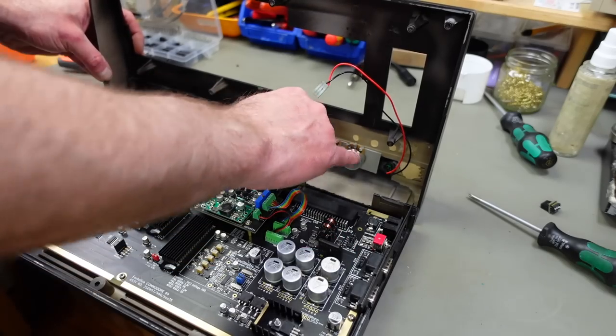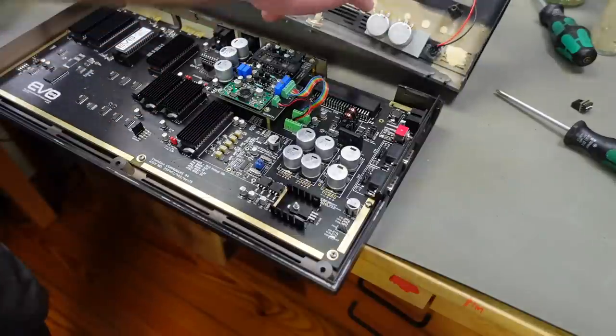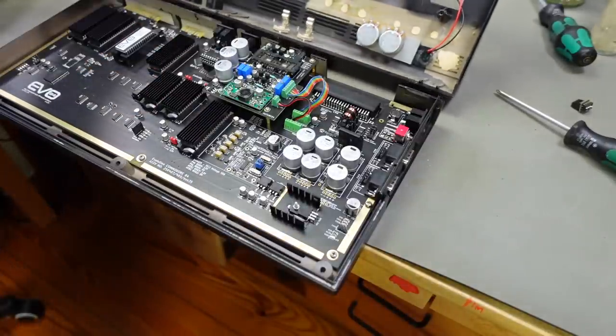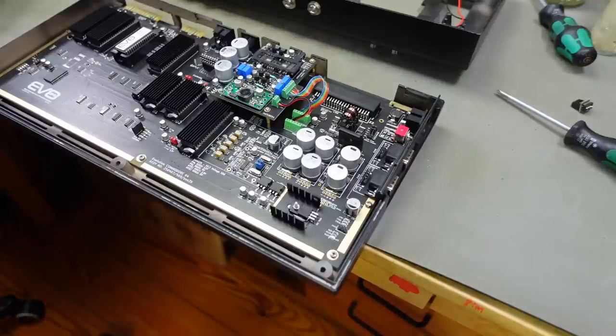So we need wires from here to here. Pin 7 is the plus 5 that is going to both of these rightmost connectors on our potentiometers. And the other ones are going to be wired to pin 9 for the first one and pin 5 for the second one. Pin 9 and pin 5.